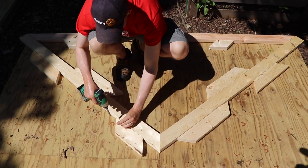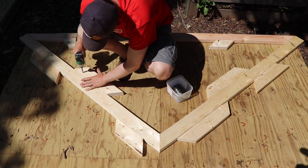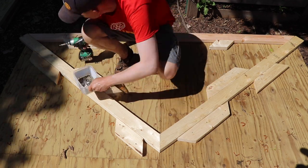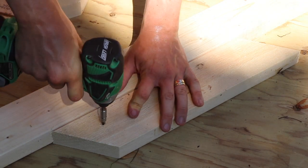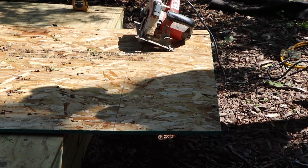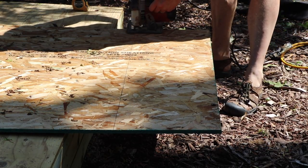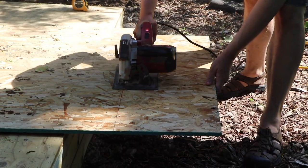So once you slide them into place, then I use the gussets, just putting them over. I've got six nails in the top of each gusset on both sides, and ten here — five in each board, again on both sides. So it's definitely a lot of nails, but you're making a gusset sandwich, and it does a terrific job holding them all together.